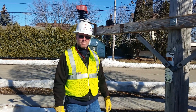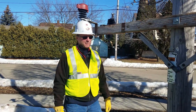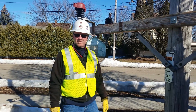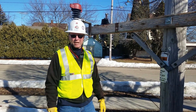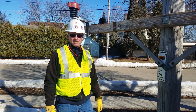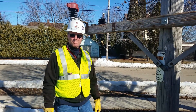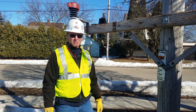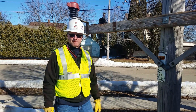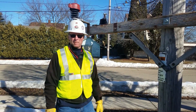One more thing I wanted to talk about — this is something that I was caught up in and burnt by — uninsulated guy wires. It's basically another ground, so you always have to watch for those as well. Don't be standing on one of them when you're working primary. It's the same as a ground wire. That finishes what I have to say about pole ground hazards.